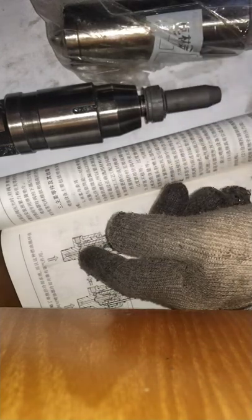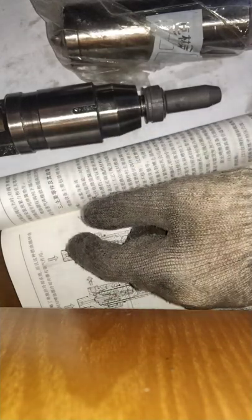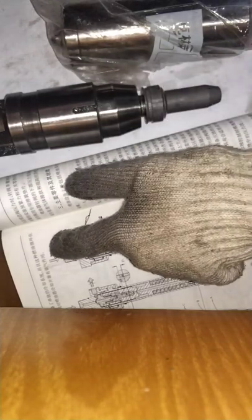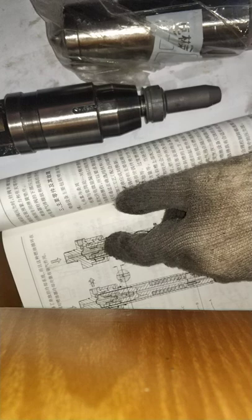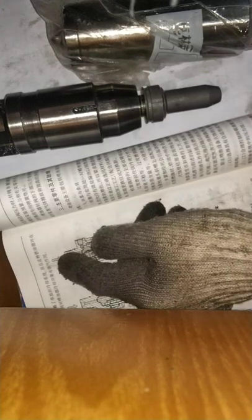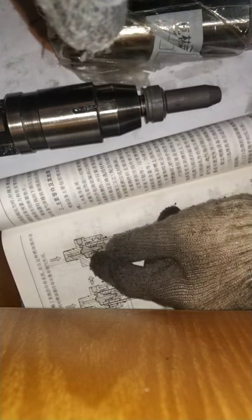When we don't have an injection, the oil circulating pump will generate a low-pressure fuel oil which can travel through the high-pressure oil pump and go into this hole here. The non-return valve has a spring inside which gives a load on it to push it down. So when the oil pressure is not high enough, this slide valve can't be pushed open — it will stay in its position as shown in the first schematic here.